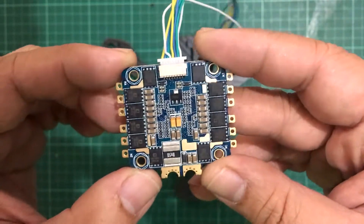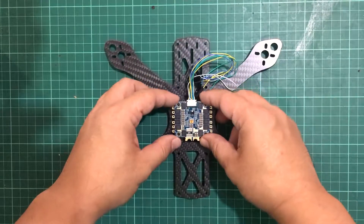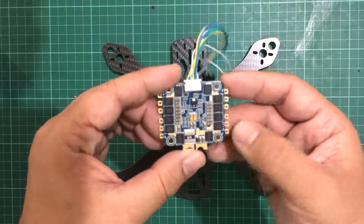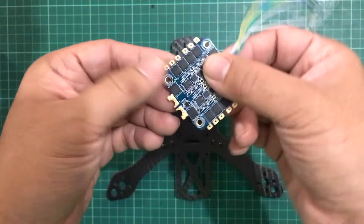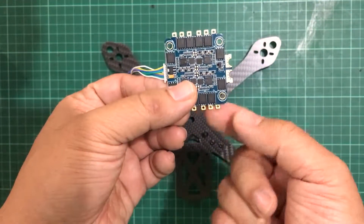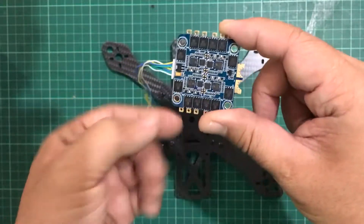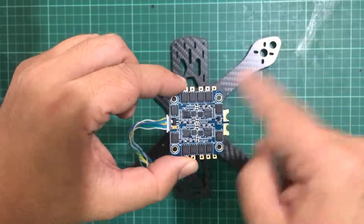One simple solution — if you're going to be mounting your ESC a certain way — you can simply flip it over. If you flip it on the other side, your motor one is going to be this one, motor two is going to be this one, motor three this one, and motor four here. So that lines up with all of your arms. It does change the orientation since the XT60 pads are now going to be towards the right, but depending on your preference, you might want to have those pads on the right of your quad anyway.